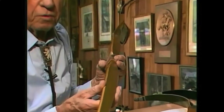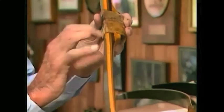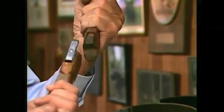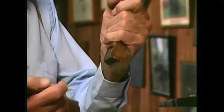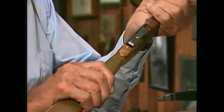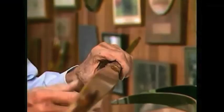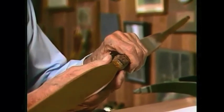The first attempt was this one here. This is even before the fiberglass era — it has a piece of vulcanized fiber on it for the backing. It's a laminated bow like the Belgians used, also with hickory. The face wood is Osage Orange, which is a harder, stronger wood. It also has the solid, non-working recurve. The bow comes apart with an iron hook that hooks into a piece of steel screwed and glued to the bow. That worked — the only advantage was it was a take-apart — but if half the bow broke, you had to make the whole thing over again and match it up with the other half.